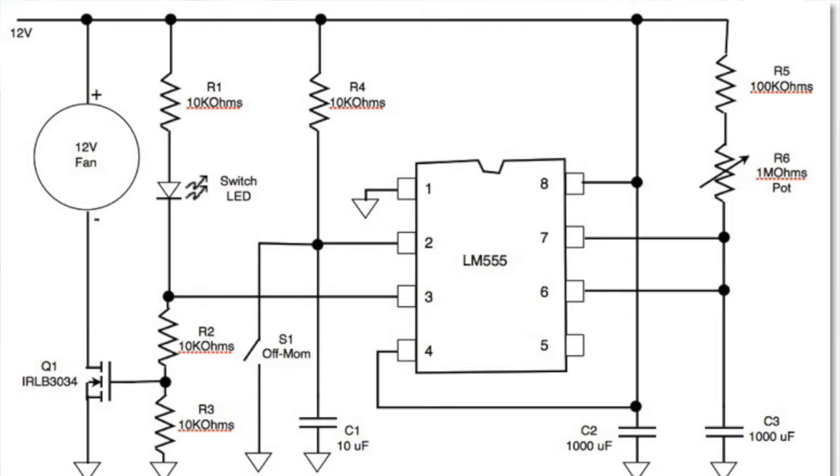So that's coming off the LM555. When LM555 pin 3 is high, that switch comes on and the fan runs. When the 555 puts out a low on pin 3, the fan goes off. Also, when it's putting out a low, the LED comes on with current going through R1 — through the LED — and that's lit up. So when you go into the bathroom in the middle of the night, you don't need a nightlight, because this LED up above is shining down and you can see what you're doing. Then you press the button — the button and the switch are one — and the light goes off.